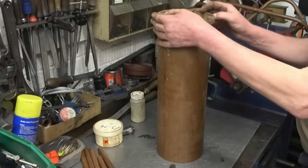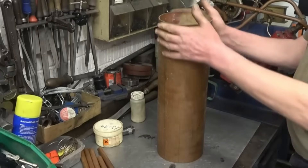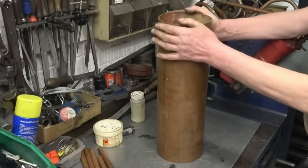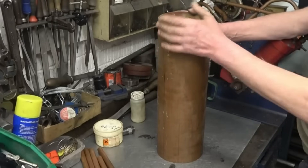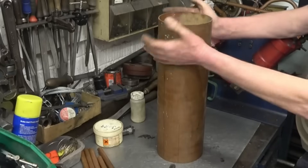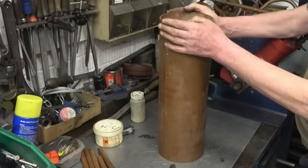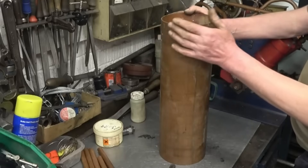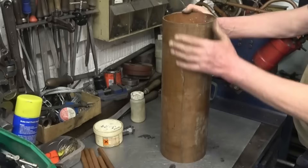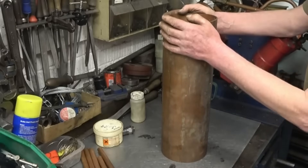A friend of mine is giving us a bronze foundation ring to go on the bottom. I need to cut some end caps or end plates and flange them. I'm going to use flange joints in silver solder. I had thought about TIG welding this because I can TIG weld copper no problem, but I haven't got any qualifications for TIG welding copper. Silver solder is seemingly a lot safer. Anyway, silver solder is the way I'm going to go.